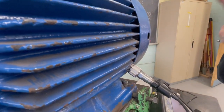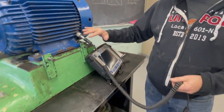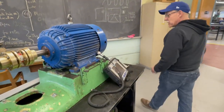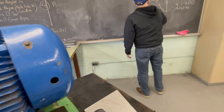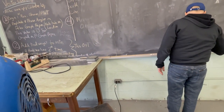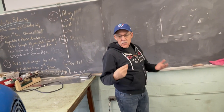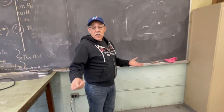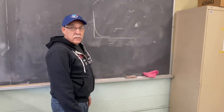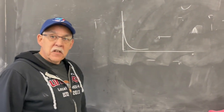Give it time to settle — there's all kinds of electronics here. I roll it on slowly, don't slam it on. Very slowly put it on, give it a shake, one-two-three-four-five, then take my reading. You have to give it time; if you don't let it settle, it's going to give you something called a ski slope. You'll always know when you have bad data in vibration because the spectrum will look like a ski slope.